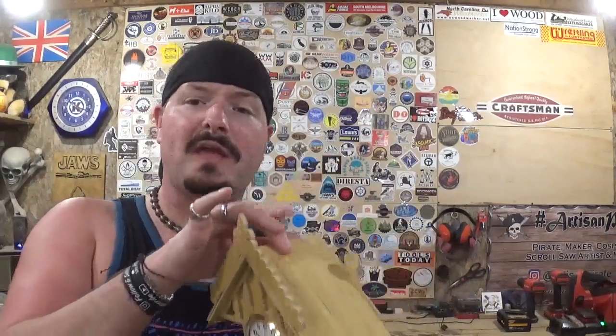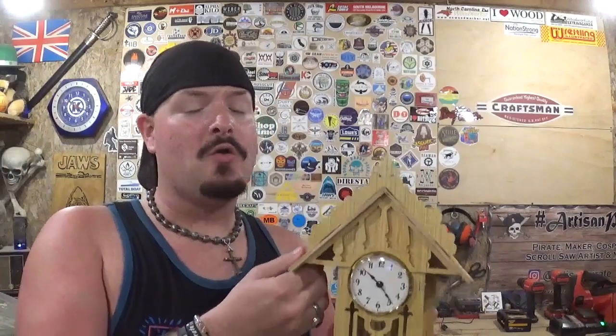And I know some people are going to question me about using the dots of hot glue on the roof, but the angled roof is hard to clamp, and I did not want to stand there and hold it until the wood glue grabbed. The only thing the hot glue is doing is holding the roof panels in place until the wood glue starts to catch and grab and dry, where it'll lock it on permanently. But that's the only thing the hot glue is used for.